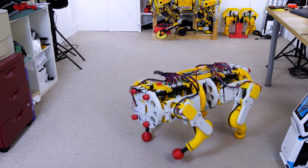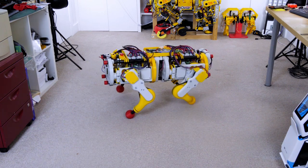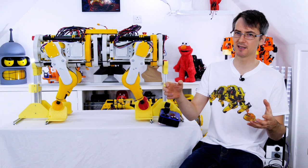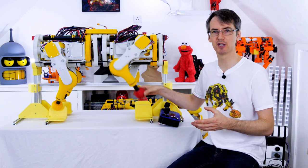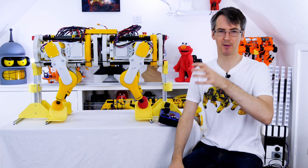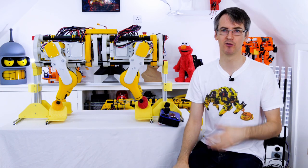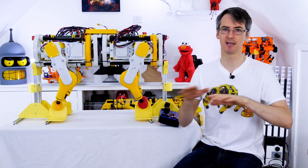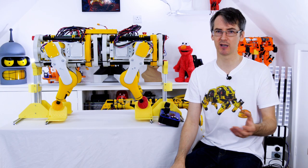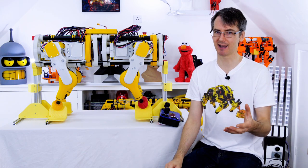There is quite a lot more friction in those pulleys because they're much tighter, so we might have to adjust the idlers, but for now it seems to work just as well as before and hopefully those motors won't melt the plastic and cause the belts to skip. Obviously there's no force control — we're just moving to fixed positions on fixed timers and interpolating between positions, as I detailed in the last video. The way stability works is that we've got those motors back-drivable with only a 5-to-1 reduction on a simple belt drive. There's a powerful motor holding its position, dumping more current if back-driven, causing almost a virtual spring, and because the legs move quickly that evens everything out like suspension.